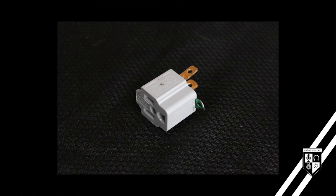Using a two-prong adapter or cheater plug for these devices will disable the safety feature. If voltage is present on the chassis of a device that is plugged in using one of these adapters, it will have no place to go. This can be really dangerous, as you'll see in the following sections.